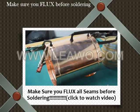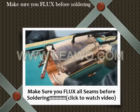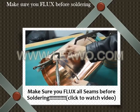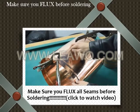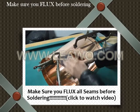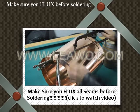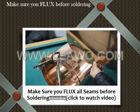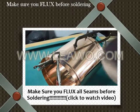Here's an example of how to clamp the pot. There's going to be a sharp side and a folded over side. The folded over side goes on the outside. The sharp side will be on the inside. You want to use these clamps to fit the cylinder to the circle as tight as possible.